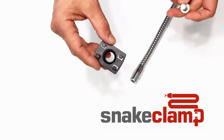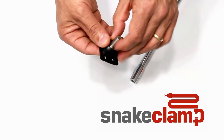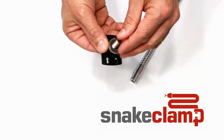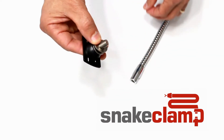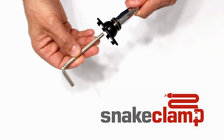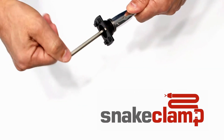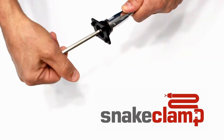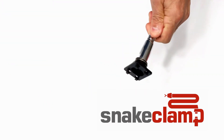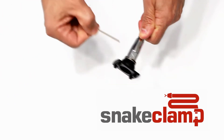The four-point adapter is attached to the flexible gooseneck tube or rigid arm with a sturdy three-eighths inch stainless steel screw, a flat washer, a lock washer, and another flat washer. Tighten the three-eighths inch screw until the spring washer is just slightly compressed. Then tighten the set screw to lock it into place.